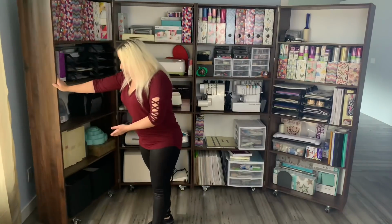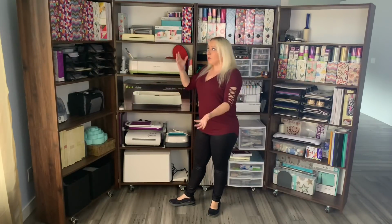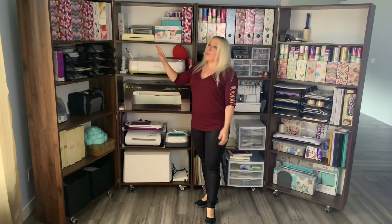I put in casters next because if the shelf was assembled just slightly different, or the bolts or screws went in the shelf, let's say on the bottom or somewhere slightly different, it could be just 1/8 of an inch or 1/16 of an inch. That way, if I put hinges first, then you would get the pulling effect of 2 shelves, if that one is just slightly lower or that one slightly higher, you will have very big strain on your hinges. So that's why I put the casters first, and then we would put hinges.